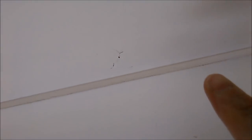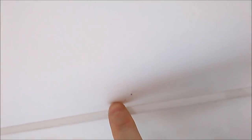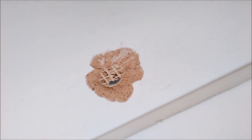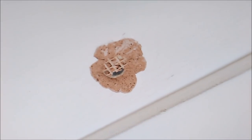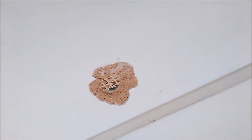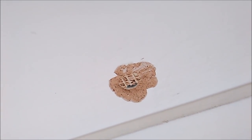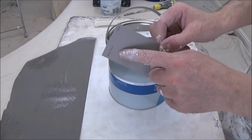On the ceiling you'll see little bits like that — that's an actual lump of plaster that's come off, and usually behind there is either a nail or a screw. Have a quick look — there you go, that's a screw in there. So a little bit of PVA on that and put some powder filler over and that'll be sorted. If it was a nail I'd probably replace it with a screw.